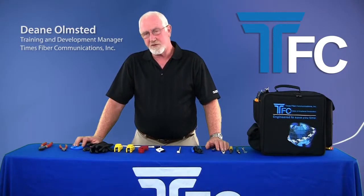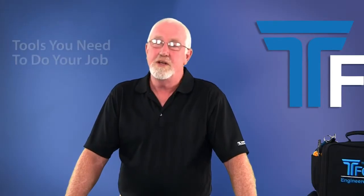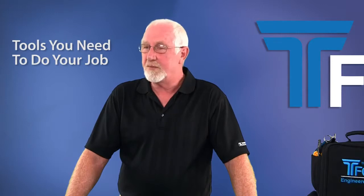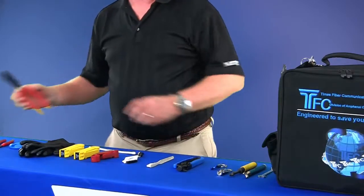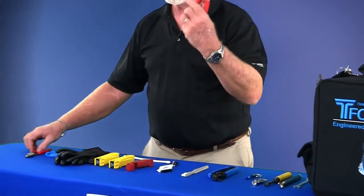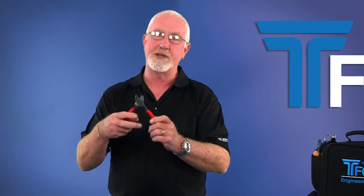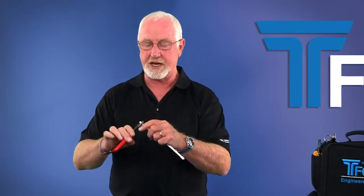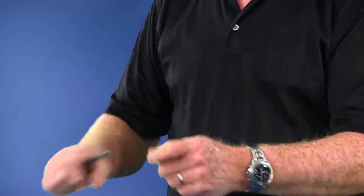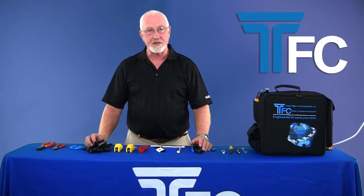Today we're going to do several modules to show you how not to make an analog connector in a digital world. The first module segment we're going to talk about is the tools you need to do your job. First thing you're going to need, cable cutters. Varieties out there, 9s that most people are used to using, cable shears that are actually better because when they do cut the cable, they make a perfectly round cable cut, which makes it easier for you to connectorize.